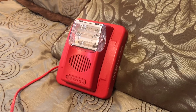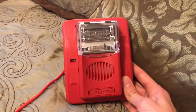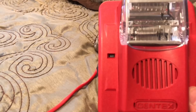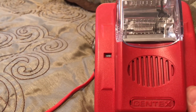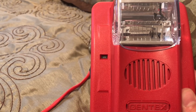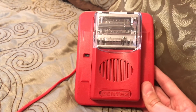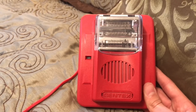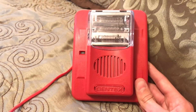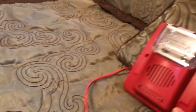For notification appliances, they had Gentex Commander 2 horn strobes and strobes. This is one of the horn strobes, and as we can see it's a Gentex Commander 2 because it's fixed candela. The candela rating it's fixed on is 177, which is very bright. The candela rating is basically the brightness of the strobe — normal fire alarms are usually 15 or 75 — but this is 177, so this strobe is pretty bright.